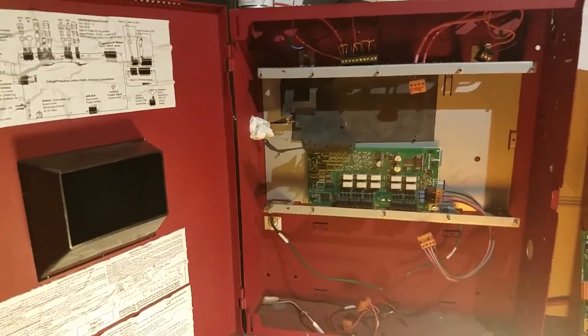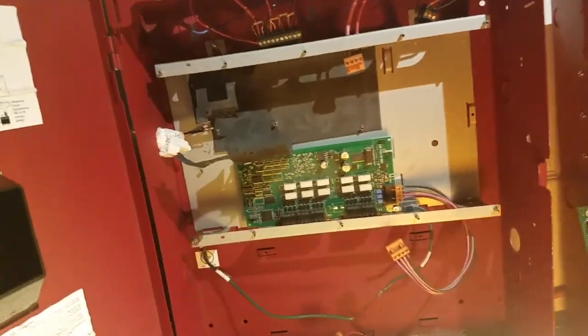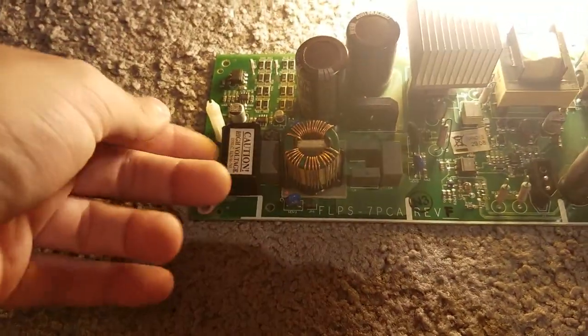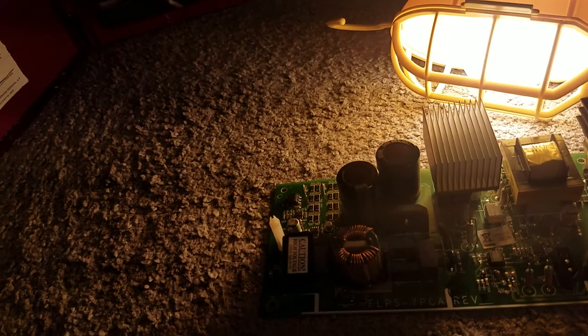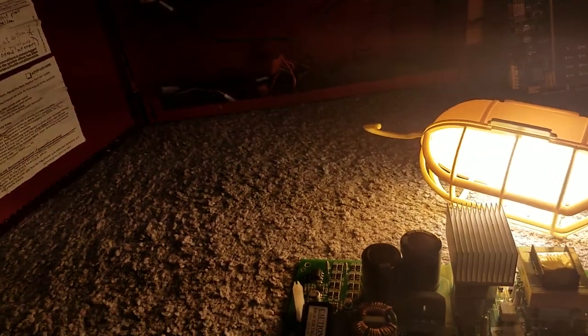And if they go to touch it, it would blow a fuse or trip the circuit breaker or anything like that. Well, I always like to have the ground wire, which is the green wire, hooked up to the system to protect it. The panel doesn't really sense for the earth wire at all, so it doesn't matter, but it does matter to me because I would like to have my system protected so it doesn't get fried.